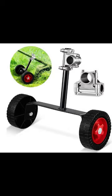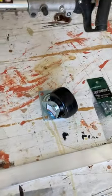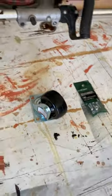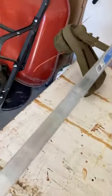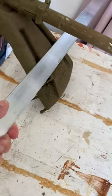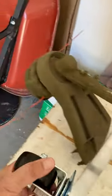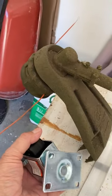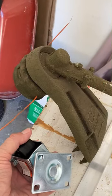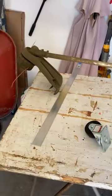I'll go through my process and my three different prototypes before I settled on a final design. I got these wheels at Harbor Freight — they were like $4.59 a piece. Then I got some aluminum bar and I'm going to fabricate it to come across the back of the weed whacker guard, bend it, have a 90-degree turn to come down to clear the line and then have the wheel. This way it will be much easier to mow the weeds, and we've got a little patch of lawn, so we'll see what happens.